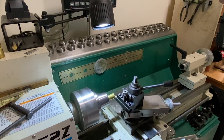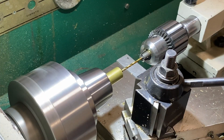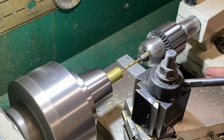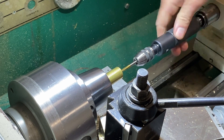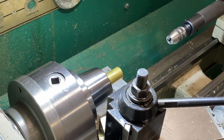First step: facing off. There's a 0.75 brass rod that I'm facing off. Then I center drill — didn't show that — but come in and drill a #29 drill, and then come in there with an 8-32 tap. You can see this tap device is nice, keeps things all aligned and it's a lot harder to break a tap with it.